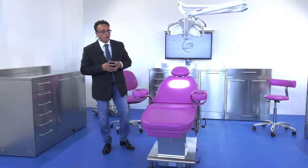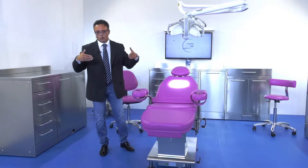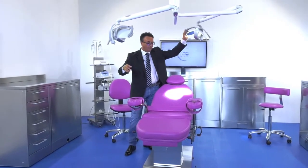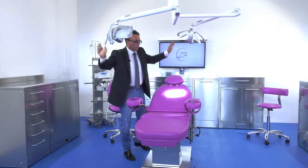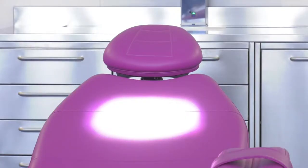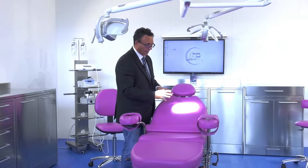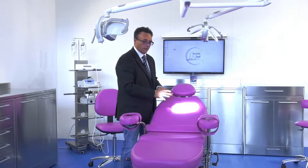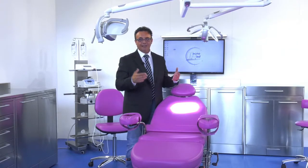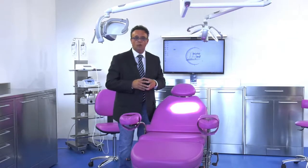Another problem was the shadow area. One head has two LEDs so the shadow area is very small. However, if we position the lamps from two different angles, we notice that the shadow area is almost nonexistent. That's because the two lamps produce 50,000 lux each, so by overlapping their beams we have a brightness of 100,000 lux. If we work on one side, we'll only be obscuring one beam of light and we'll still have 50,000 lux. That's why we call it QuadriLED — because we have four intercrossed beams of light with which we can eliminate the shadow areas and have perfect brightness to work with.